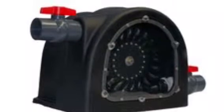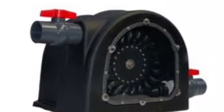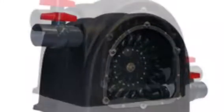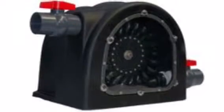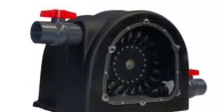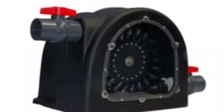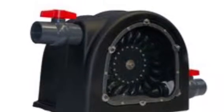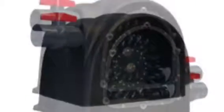This is a picture of the low flow generating heads we'll be using on this project. They are Pelton wheel driven. There are 2 jet models. They will range anywhere from 3 foot to 525 foot of head, meaning the total amount of fall you can generate on the pipe from one end of elevation on your property to the other, from as little as 127 gallons per minute to 800 gallons per minute. These units are capable of generating between 12 and 1600 watts at 32 amps, which gives you approximately 1.6 kilowatts per day. If you need more power, they have an option for that as well.